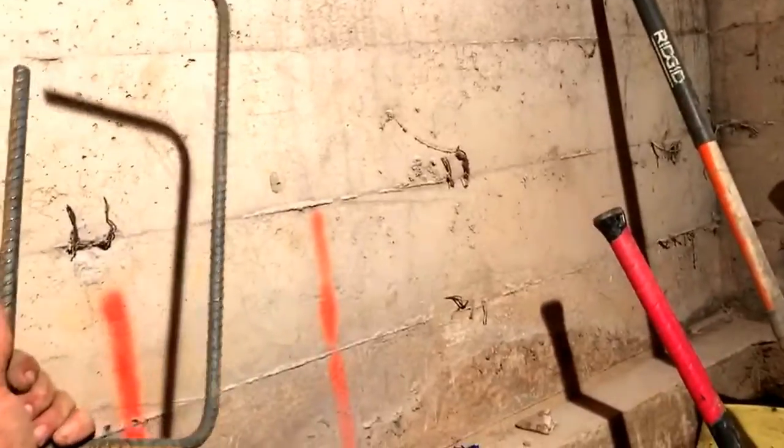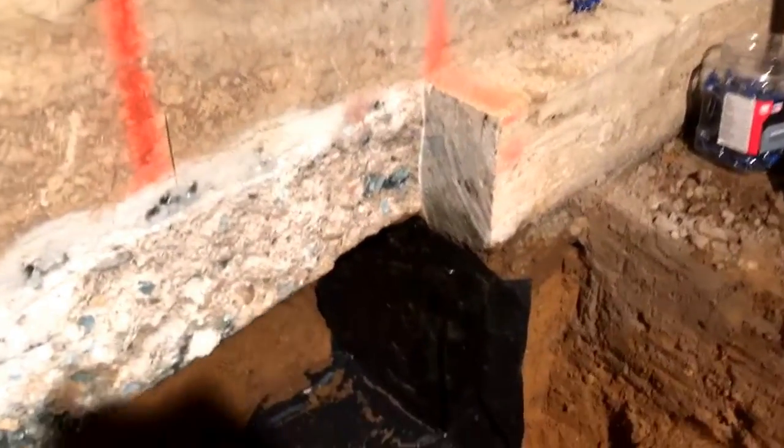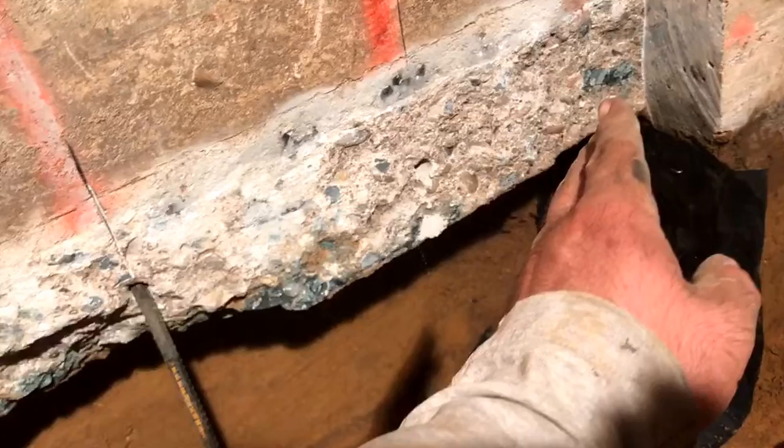You don't really have room to drill from underneath. So what you do is you make a piece of bar that resembles this right here. These will get epoxied in and they will rest in there like that. Then there will be one every 12 inches, and then there will be a panel — right there — and then it will be pressed against here and then it will be formed, filled, and vibrated.